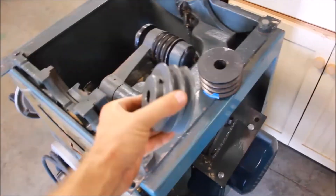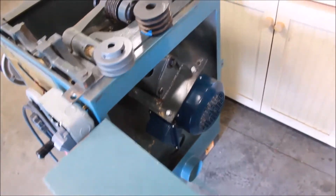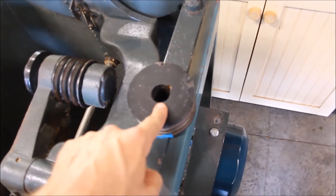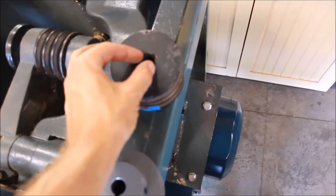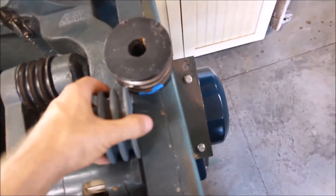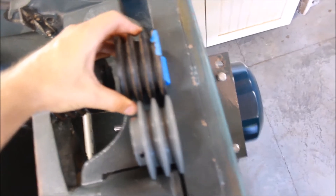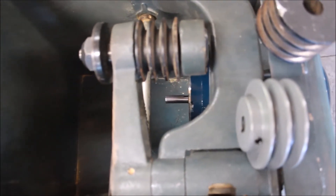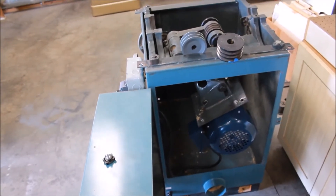My replacement pulley for the motor arrived and I'm going to use a two-groove pulley with a 5/8 bore, because this new single-phase 2-horsepower motor I put on here — the original was a three-phase 5-horse with a non-traditional diameter shaft. Because it was a Taiwanese motor, not a NEMA frame, swapping out the motor means we can't just put the old pulley on; it was even too big to use sleeves or bushings. So I'm going with the two-groove, which will be plenty. These line up just right — we'll get it on the shaft, lined up with the motor, and then move it back and forth with belts to make sure everything's aligned just right. Very pleased with this pulley — it'll be a good swap out for this North State Taiwanese table saw.